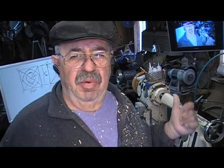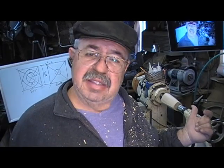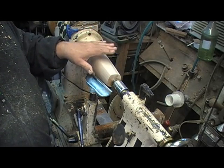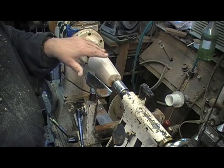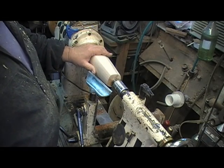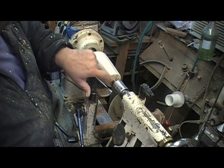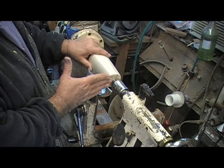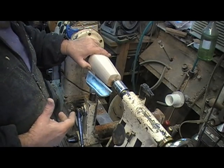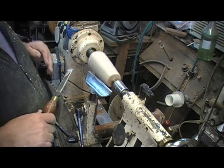What's the next step? Well right now we've got a sort of square block of wood — we've got to hollow it to make something out of it. To hollow it I need to hold it, and my first inclination would be to stick this onto a glue block — just flatten out this end and stick a glue block on it, then flip it around and turn it. But some rookie turners aren't very good at glue blocks and I don't want to get you hurt or waste a project. So I'm going to crank the speed up — I'm between centers and I'll be hitting on a four-sided piece.